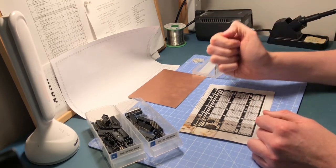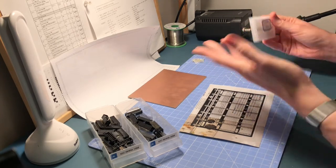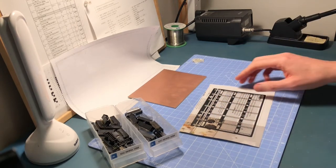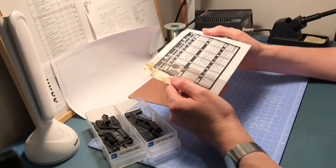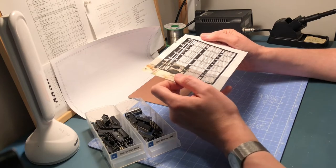What I've heard you can do is centre punch each of these holes just to stop the drill walking about a bit. But we'll come to that in a later video because that's going to take forever. I am a bit worried about these tracks though — they are quite thin. But let's just transfer them and see what we get.